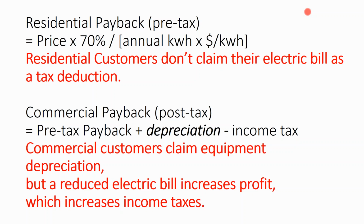You're selling your electricity. So if I'm paying income tax on that 9 cent purchase, that's going to reduce the cost effectiveness of the array. Whereas if my electricity is just rolling off retail of my bill, that's post-tax income. If I'm reducing on site at 11 cents and then selling back at 4 cents, I'm being taxed at the 4 cent sell, but not the 11 cent sell. If I sell all of my electricity at 9 cents, I'm going to be taxed at 9 cents for all of my electricity. And so actually, when you complete the analysis, doing an avoided cost buyback, but being able to reduce your retail price electricity, is often more cost effective than a power purchase agreement with the utility that's set at still less than retail.